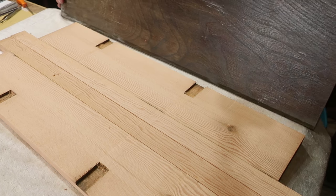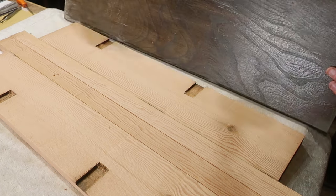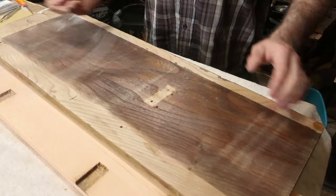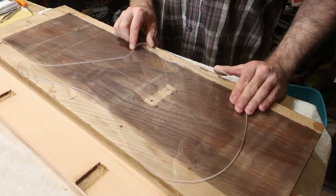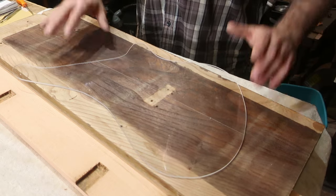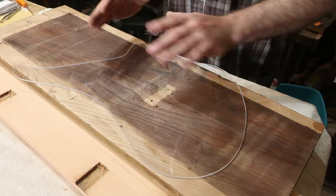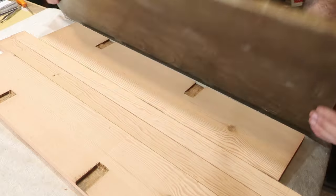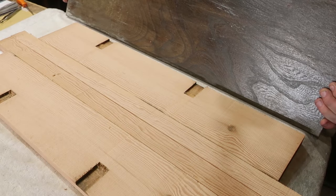Also, this piece of wood is not perfectly flat. It sort of starts to curve up a little bit on this side, but I'm not using that bit. I'm using mostly up here. So this bit over here isn't quite flat. So, yeah, I'll figure it out as I go, and I'll finesse everything to be nice and flat and get some nice tight glue joins, and so that the thing doesn't fall apart, because that's bad.